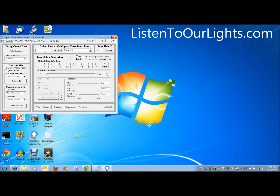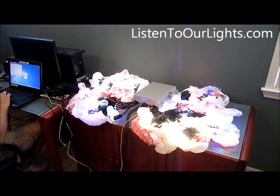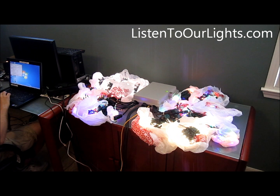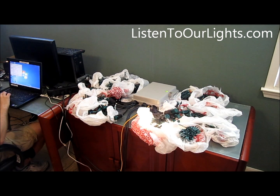You select the unit — just as easy as putting in the ID there. Then you say on at 100% and you make sure that all the lights are on. Then you can do a shimmer, a twinkle, a fade. I like to, since I do LEDs, do the fade a little bit slower just to see if I'm getting any significant flickering. You can also run through a nice little chase sequence where it turns them all off, turns them back on, and you can do a shimmer or a twinkle while doing that. You're basically looking to make sure that every single channel is doing something.